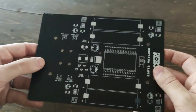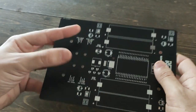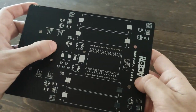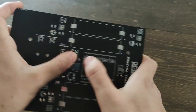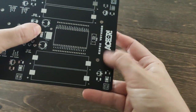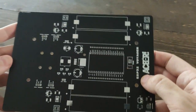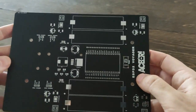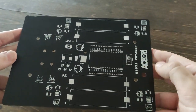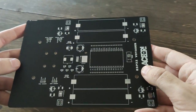So this is the circuit board itself. I also have the hole pattern right here for a standard aluminum servo bracket — you see those servo brackets all the time — and I wanted to include that whole pattern right there. This small hole right here is actually for the antenna, so the antenna can go down inside and then come back out and screw right here. Having that external antenna was really important so we can get some long range. I've tested this with PS3 controllers and also with ESP Now, and the range is really impressive. With the FPV cam, your camera has a pretty long range — three, four, or five hundred feet — and the ESP32 has that same range, which makes for a really fun robot.